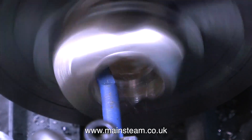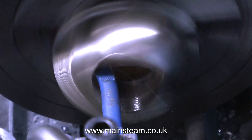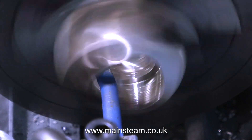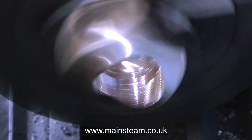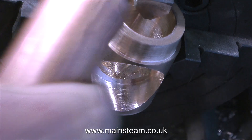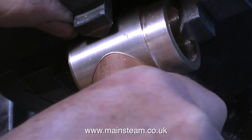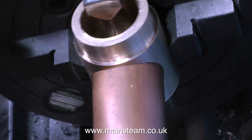This boring operation is nearly completed. And now, when I try the piece of copper tubing — which will be the chimney — in place, it fits perfectly. Not too slack and not too tight. Quite a snug fit. I'm not going to silver solder this chimney in place at all. The bottom part, the extension to the flue tube, is going to be painted black, but the chimney needs to be able to be removed for polishing.